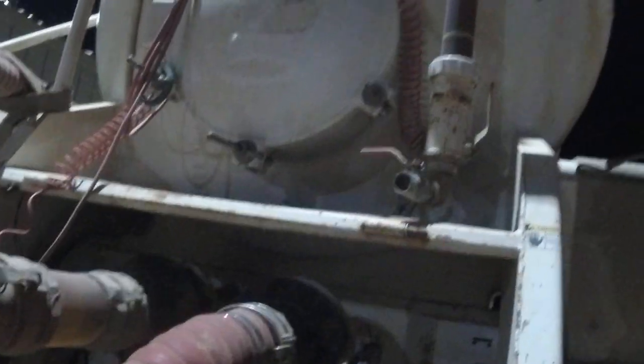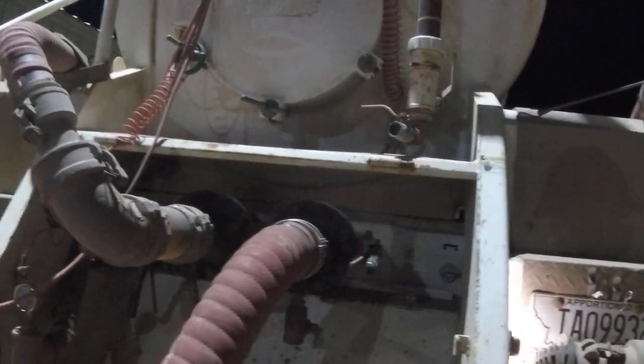That's pretty much all there is. Double check everything one more time, listen to the pump — good. Now you just wait. Right now I have 140 barrels on my trailer — you can see that, it's already starting to go down a little bit. That red and yellow line tells me that's 140. That way you know how much is on your trailer — I have it marked: that's 100 right here, that yellow line, then 40, 20. Somebody asked me on my channel how you can tell, so that's one way. Some people have axle weight measures in their cab and can go by the weight showing on the trailer too, but I don't have that on my truck.